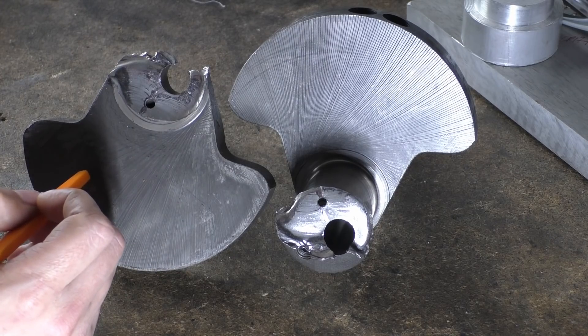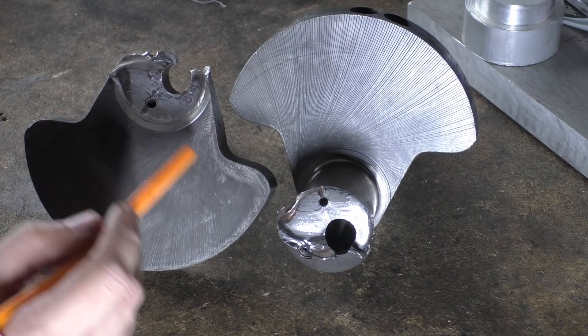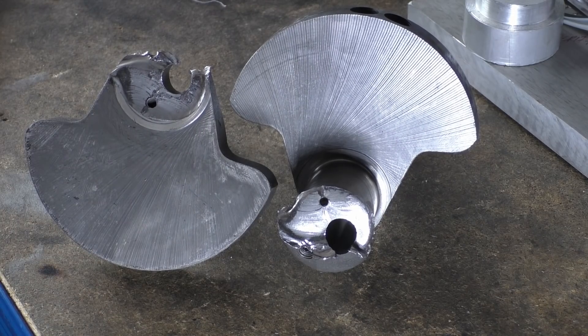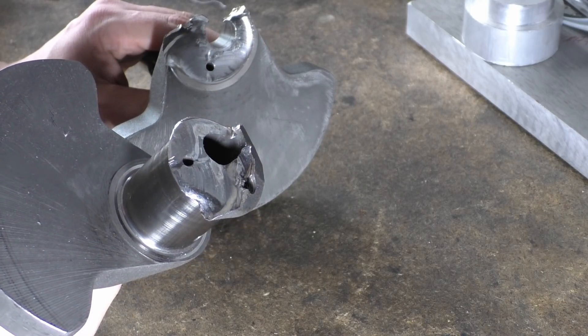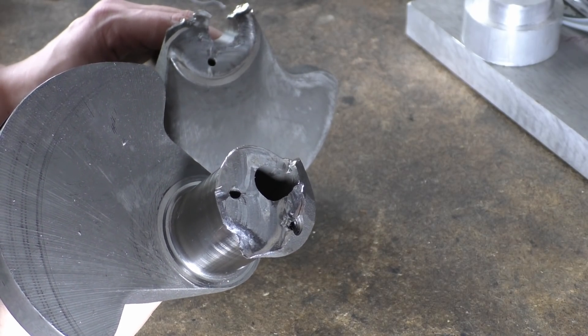I've done a CAD model of this so I'll show you some pictures of that as well. There are signs we can look at. Ideally, when you have a failure like this, the engineer doing the failure analysis should be the person that takes it apart. That very rarely happens — something goes wrong, it goes crunchy, maybe it shoots out, and you take it apart and go 'why did this fail?' and send it away for failure analysis. But just by taking it apart you've probably compromised a few things, because these surfaces give you witness marks — this is like a crime scene.